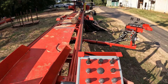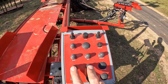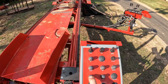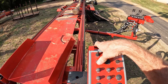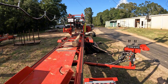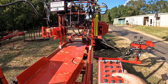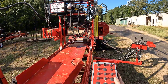We've got the machine running. We're going to come back to our remote box — it is on a lead — and I've got push buttons on here to move that guide arm in and out. We're going to bring this head back to us so we can see that a little bit better. When I push this button in, that guide arm should move in towards the log, and when I push it out that guide arm should move away from the log. It is moving but it's hanging a little bit, so we need to go in and readjust that. You can see it's got a little bit of movement but it's not moving as much as I'd like. So we're going to go in and make that adjustment.